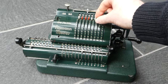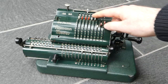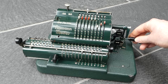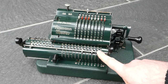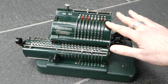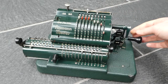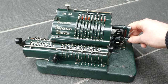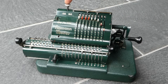It looks like a pinwheel machine and you use it almost the same way. You have these input levers with which you set a number, a crank on the right hand side, and if you turn the crank that adds the input to the main register and increments the counter register. The input gets cleared automatically, so you can just add another number by entering it and turning the crank. You can also clear the input manually with this button here.